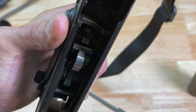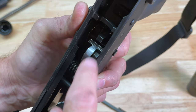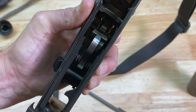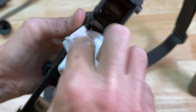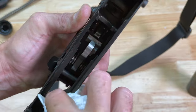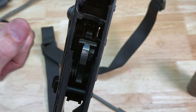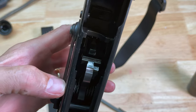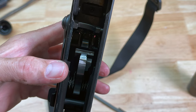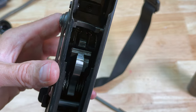I don't know how many of you guys have tried out the ALG trigger on an AK platform, but these things are fantastic. If you polish them up real good and get any of the bumps out of the hammer assembly, the action on this thing is like riding on ball bearings — very smooth. Typically an AK will have that kind of bump when you're cycling the bolt back, but if you do one of these up right — I can't take credit for that, that was actually Clayco, he's got a pretty big AK channel here on YouTube.